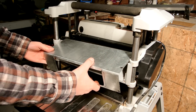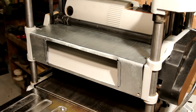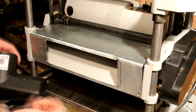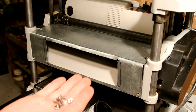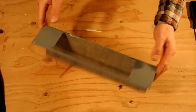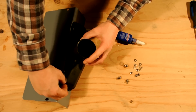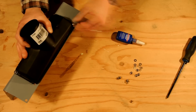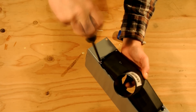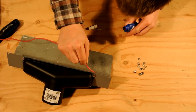As you're going to see, I should have put the bend in first and then cut the hole out, because I had a real tough time bending that small little lip — but hey, that's how we learn. I'll also have a link in this video to show you how I made this brake step by step. Now let's make sure this fits in the thickness planer. These are the 10-32 nuts and bolts I mentioned earlier — that's how I'm going to fasten this vacuum attachment to the actual flange. After a quick coat of paint this is ready for final assembly. I put a drop of permanent Loctite on the threads because I don't want those nuts to back off from the vibration of the machine.